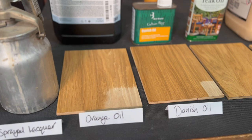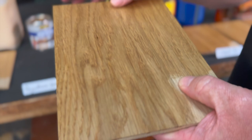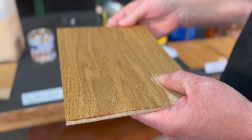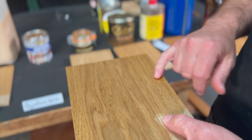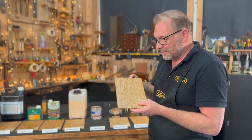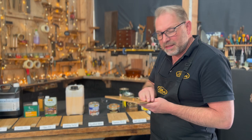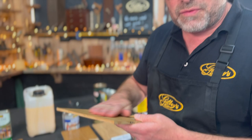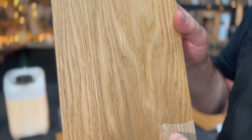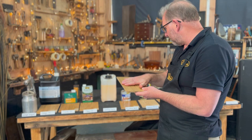Polyurethane varnish — it's a varnish, it's a coating. It's dried overnight because it's so warm in here. You can see there's a film coating over the surface; you can see the grain. It's a nice finish and it's been a popular go-to choice for decades. But you are coating the wood — you're not going to get a natural finish. Far less popular these days. Sanding sealer was dry within about 15 minutes — brilliant stuff. But completely impractical on heat-treated or hot surfaces and general wear and tear.